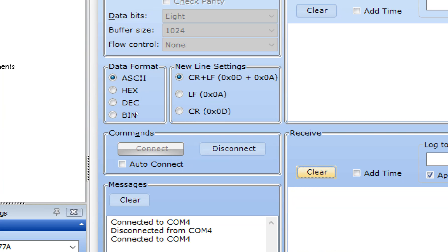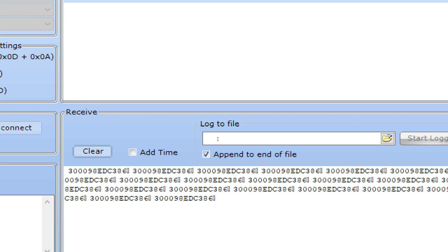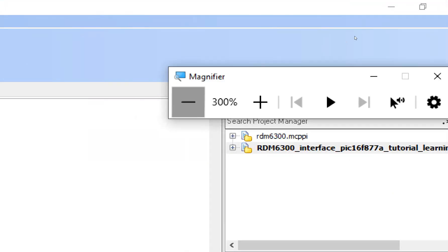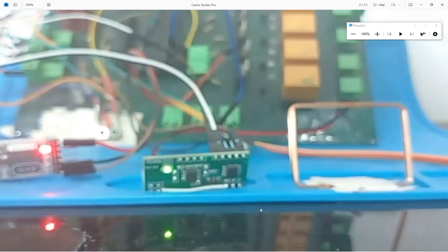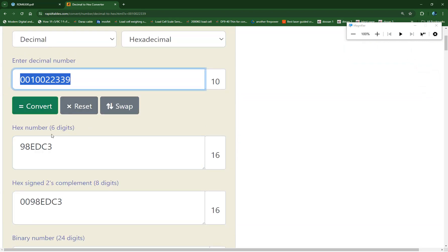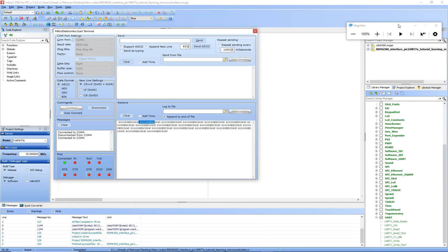Connect and see — I swap the card. Okay, this is the data we are receiving. See it receives 98EDC3. Now this is the data received. So what I do is you can see the number written on the card — 0001 00223 39. I convert this hexadecimal to decimal and when I convert this number to hexadecimal it is 98EDC3, so that is what we are receiving.